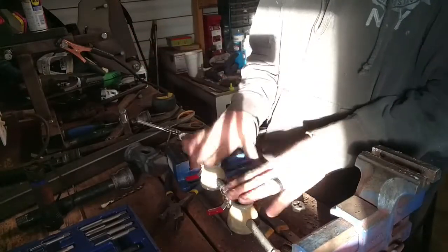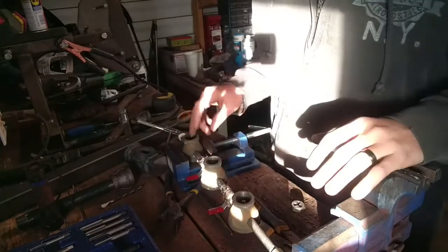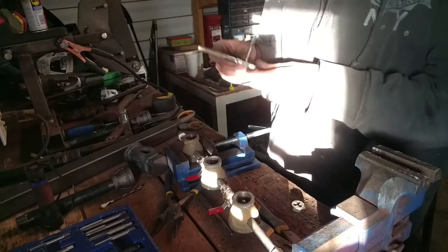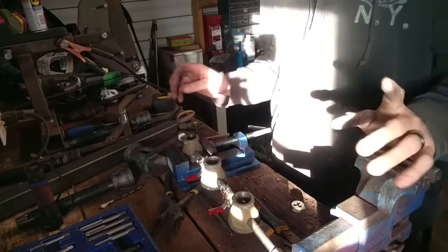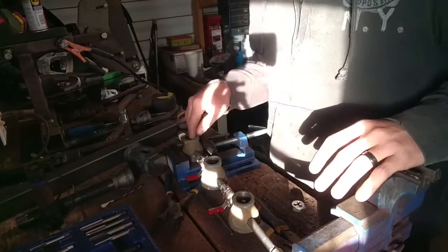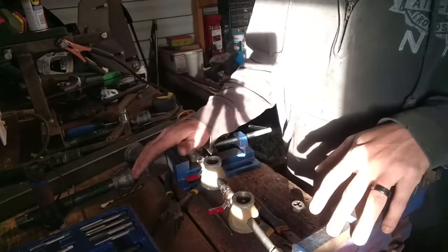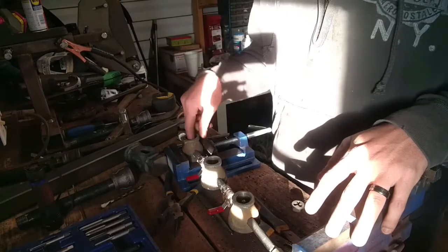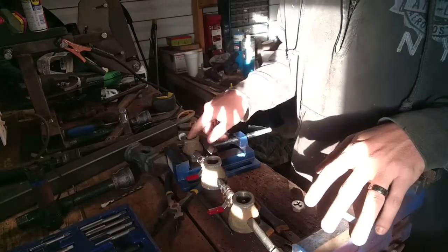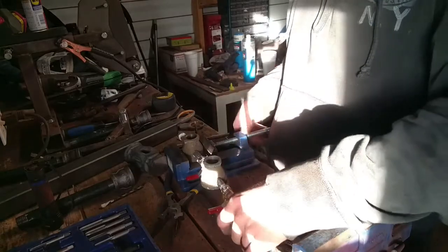It's all ready to go, just got to put our tips in. Got this one set in the vise nice and flat. I'm going to center punch the spot where I need to drill the hole. It's a 3/16th drill bit and tap - fits a .023 MIG tip, or at least the MIG tips that I have. You need to make sure you get this thing as centered as possible. It's very beneficial because your mixture will mix better going down your tube into your forge. Put some of that TFE paste around it and screw it down in there, tighten it up.